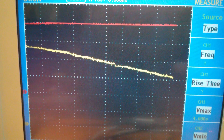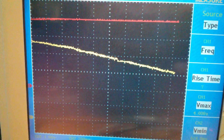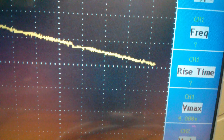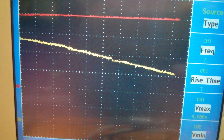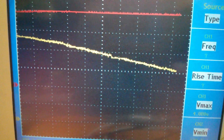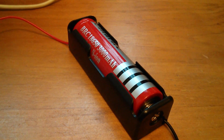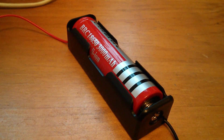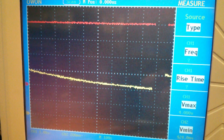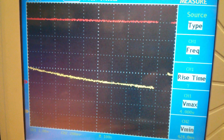There's the first screen full of data. I'm on 100 seconds per division, so that represents about 16.6 minutes. The voltage has maxed out — it says 4.08, so about 4.1 volts, though I'm not sure how precise my oscilloscope is. The current has got down to about 600 milliamps. You can probably see now why having a rubbish battery that holds very little charge is an advantage — all of this is happening so much more quickly. About 30 minutes in, the current has dropped to nearly 400 milliamps and the voltage is still constant at 4.1 volts.